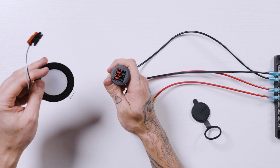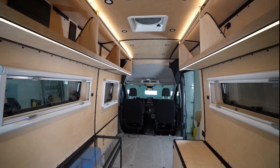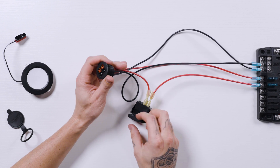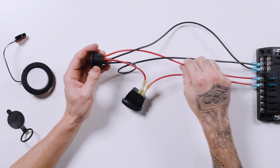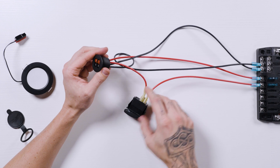This lives in the wall and then you can remove whatever circuitry you need after the fact. We did these on all of our upper cabinet lights. We ran two separate circuits to the two different sets of ports on this Anderson connector. The way we have it wired up is we have negatives going to the black terminals — just straight across. Then one of them we have going to the positive without a switch, so one of these is constant power. This upper one is the constant power Anderson connector.